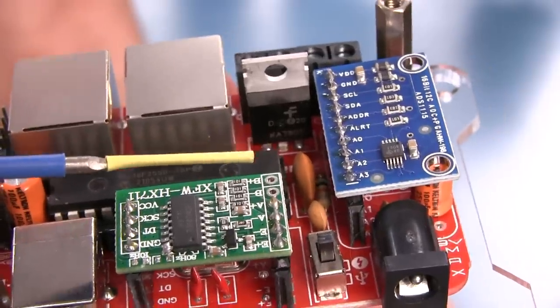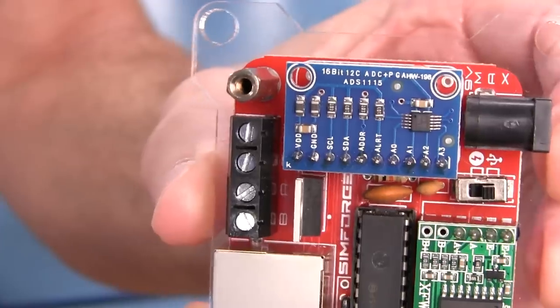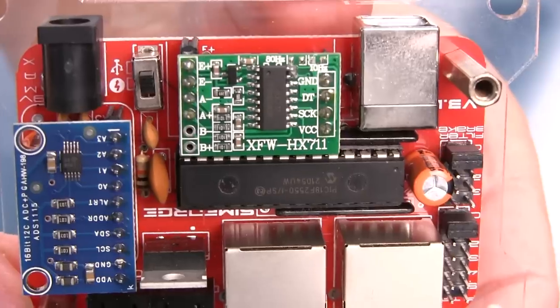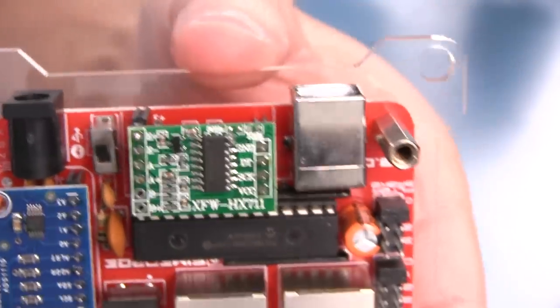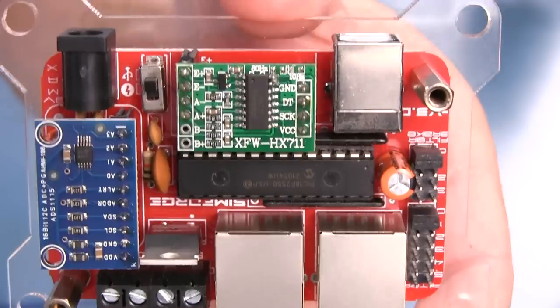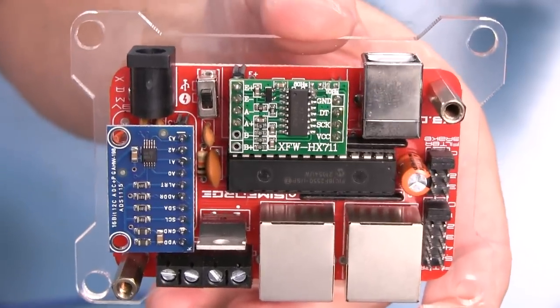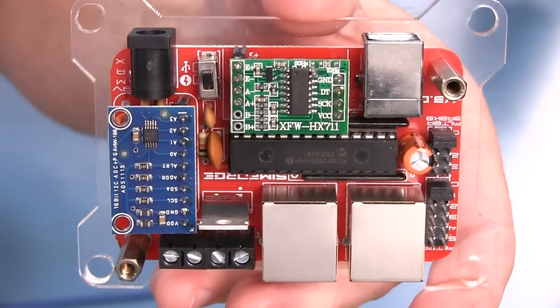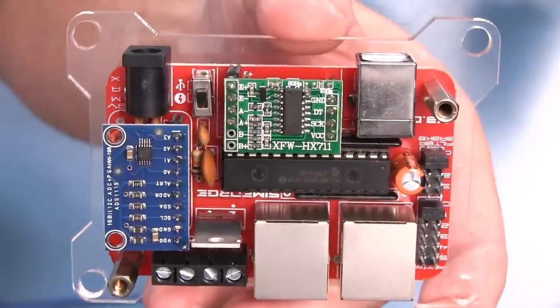The most labor-intensive update has been to their circuit board design and components. The clutch and throttle pedals are now being controlled by a 16-bit board, with the brake pedal being updated to a 24-bit controller board. This board is unique in that it does analog signal amplification and analog-to-digital conversion of the load cell signal all on one chip.